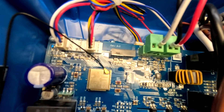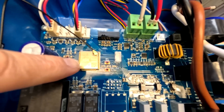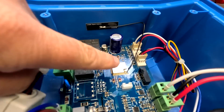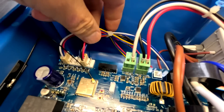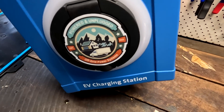Interestingly, the main PCB is powered by an ESP32 — the same chip as on the Victron boards. There's another PCB below for the touch display on the front. We've got a Wi-Fi antenna connected directly to the chip, sitting at the top of the charging station, along with several connection cables — one going to the display PCB. There's also an LED ring: this charging station has a white LED ring which I believe uses RGB LEDs and can be fully programmed to show the state of the charging session — charging, fully charged, fault, standby, and so on.